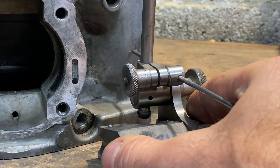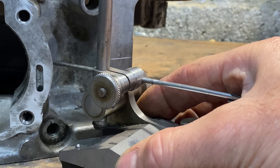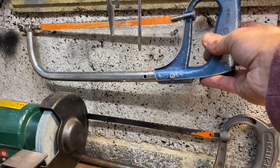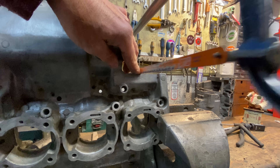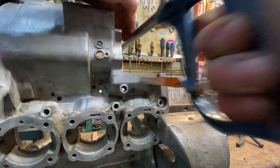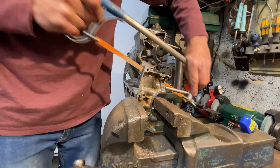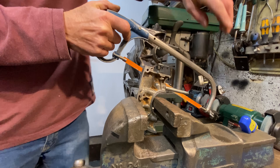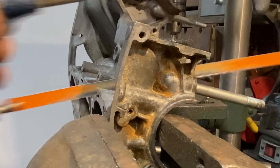The sharp point of the scribing block leaves a nice line on the oxidised aluminium surface of the crankcases. With the line scribed I grip the crankcases tight in the vice, making sure I grip on a part that's not going to be needed. Then I use my hacksaw and cut down the line, separating the crankcase into two pieces. It can take quite a while to cut the crankcase in half and you have to attack it from many different angles, but the main thing is to saw through the metal gently, letting the blade cut without being forced, and you'll get a nice straight line.